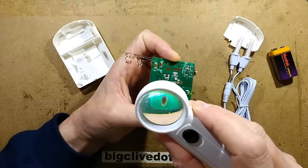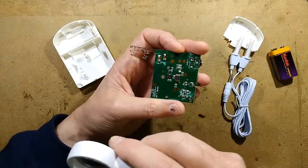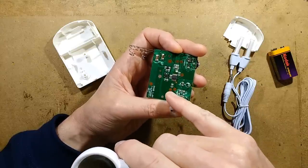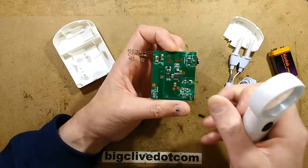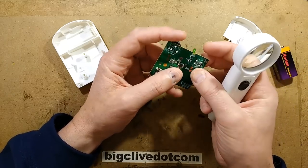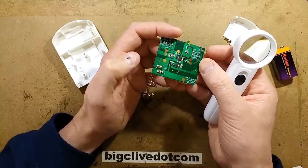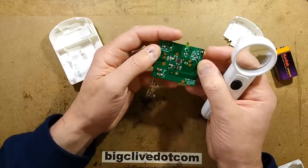What I thought was the regulator is marked SIM144-1. Power is coming in, there is a protection diode, and the output is going up here. It has three connections going over, the little button here, an LED and a small resistor for the LED. The button is connecting the positive rail to the chip.